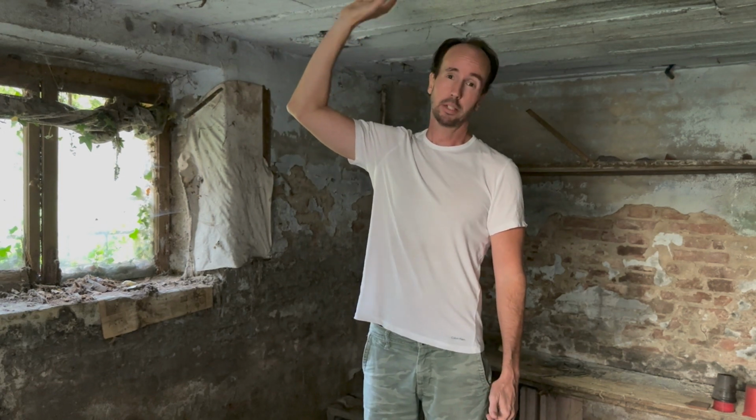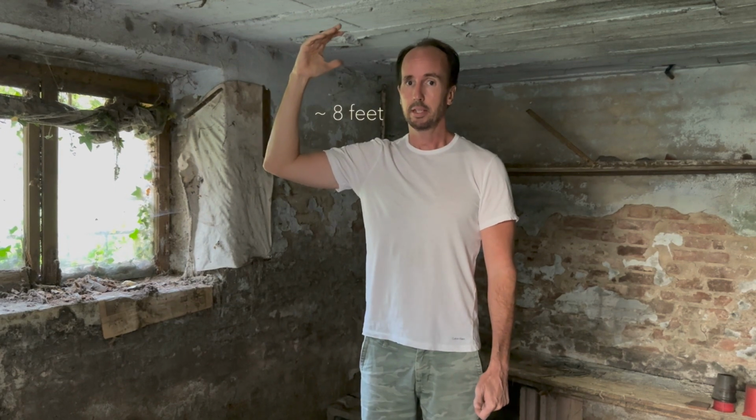Okay, so what's the reason for digging this hole? We would like this basement to be a livable space. Where I'm standing right now, we're planning to do a cinema room. And the height in here today is about 200-ish centimeters. We want about 240 centimeters down here. So in order to get that, we need to dig ourselves downwards. To be able to do that, we need to check the depth of the foundation. The foundation in this house is about 60 centimeters down below the floor level.